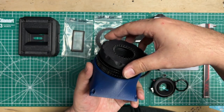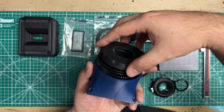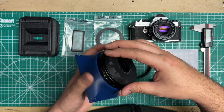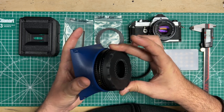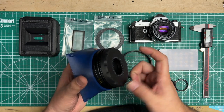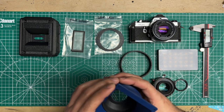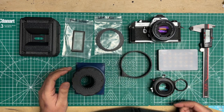I'm going to thread the lens board the opposite way first — I had a little trouble with the helicoid because I was doing it while looking at the camera. I just used two fingers to tighten it because that should be enough strength. When you pull on the shutter or the cocking lever it should not move, but if it does just tighten a little bit more. Don't over-tighten anything on plastic or you'll break or crack something.